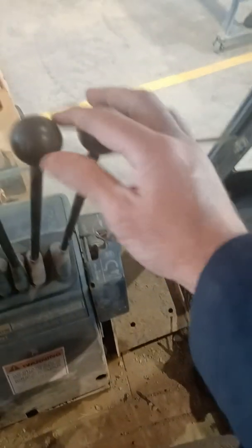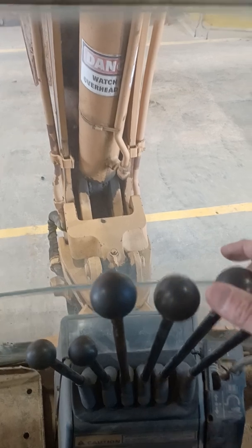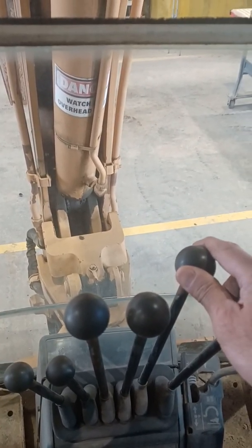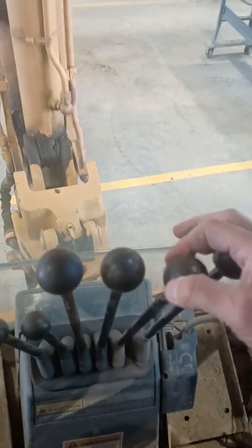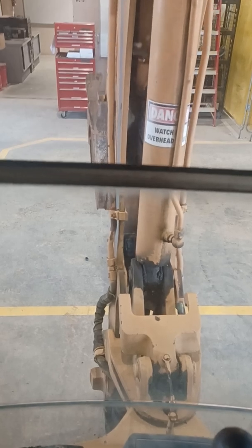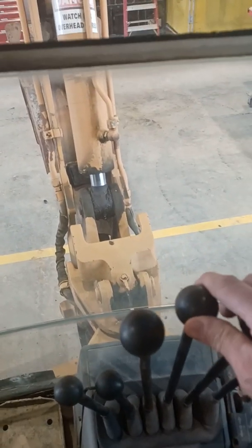Again, unlocking it — pull it towards me a little bit to take the force off of the lock linkage, lift it with the pedal over there, and then bring it towards me to lower it. Counter-intuitively, I brought the linkage towards me to get the boom to fall down. You get that bouncing — a little unnerving if you're not expecting it — but once you're aware of it, when you start lowering it, it becomes positively connected again.